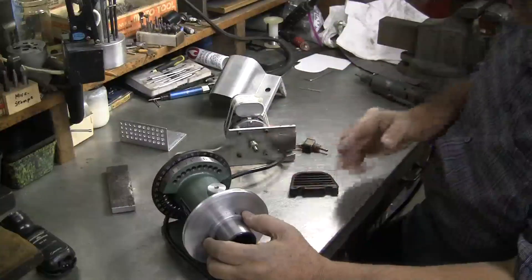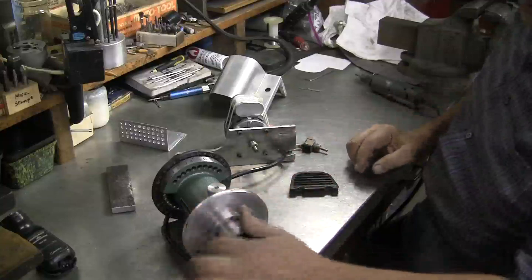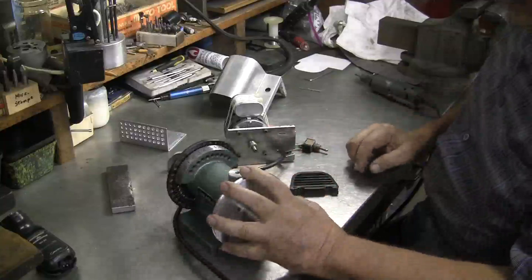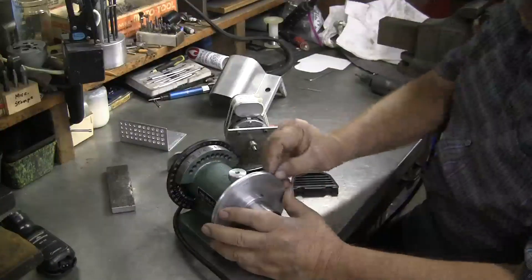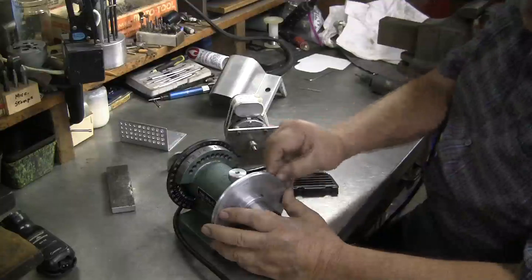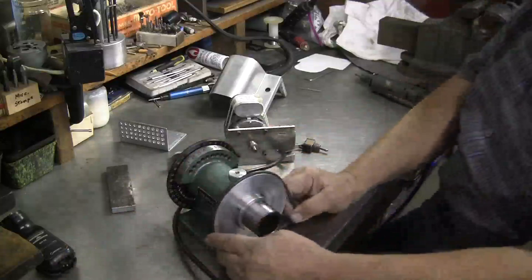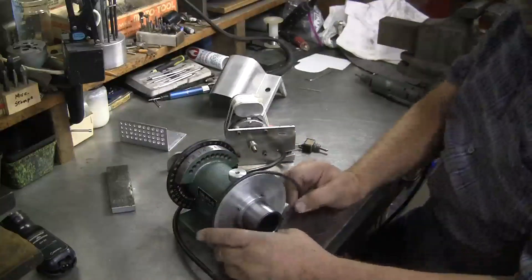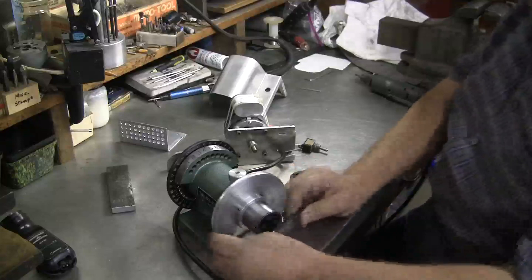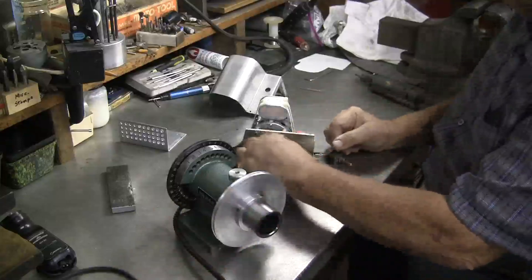You should know how to make your own components. The first thing is about a 5-inch diameter pulley that goes on the spin index fixture, with a 210 diameter tool bit for an O-ring groove. I forget what number O-ring that is, but you can figure it out — there are charts on the internet. And then I made about a half-inch pulley for the motor.